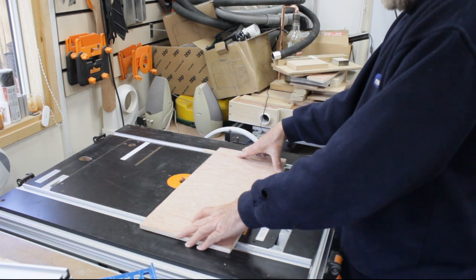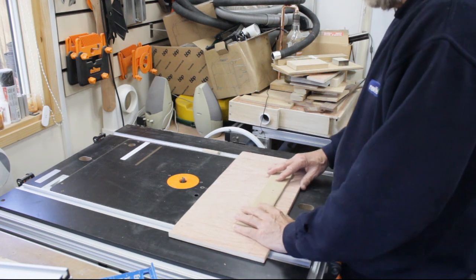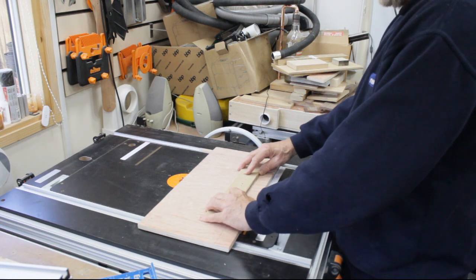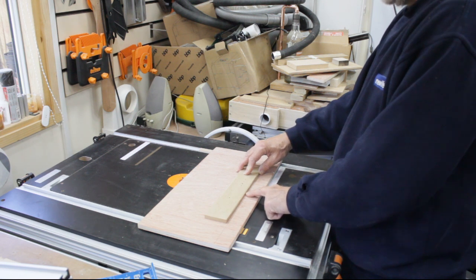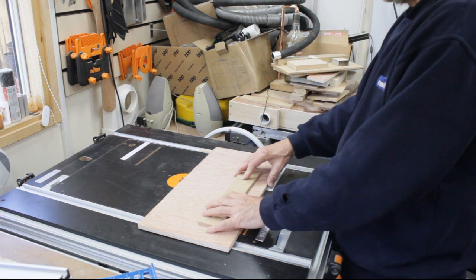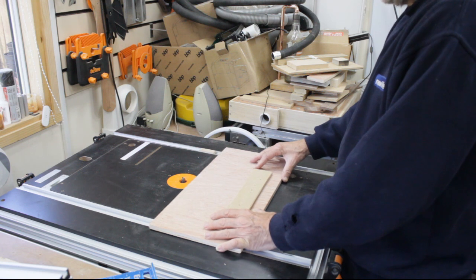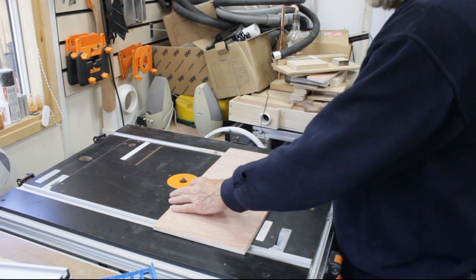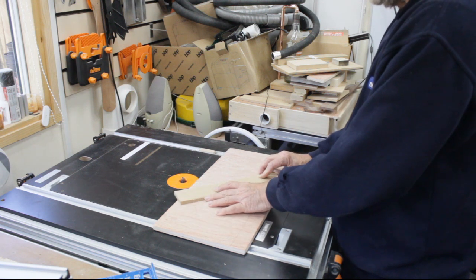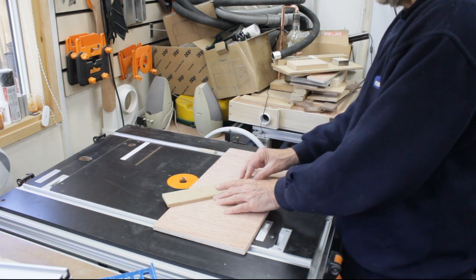And then I can mount the pieces of wood on top, run them through, and then put a register of some sort so that that groove will then have a marker alongside it, and I can just move it along and it will be a set distance, and then run it through again. That seemed ideal, and in addition it means that I could also put a temporary fence on it that was diagonal and do the same thing and just move it up as I wanted to.